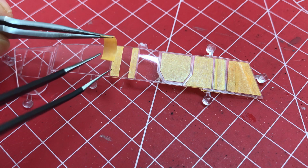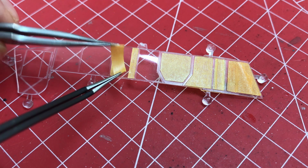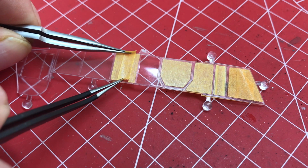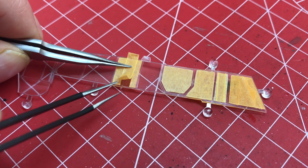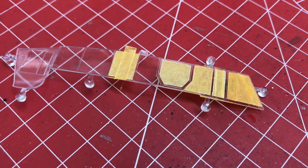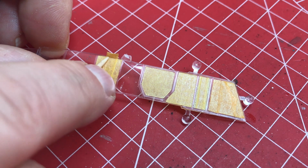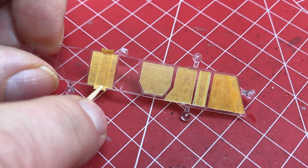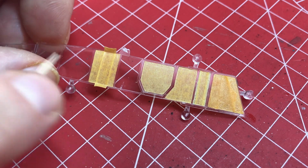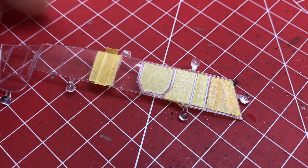We're then going to put our last piece of tape on, which is going to fill our gap, and then we can cut our top edges. So it's the same process as before. But we've only ever had to cut the tape on two of the edges. We've not had to cut it on four edges. We've only done the top and the bottom, and we've used the edge of the tape to ensure that we've got a nice straight line. Of course, that only works where you've got a nice straight line.